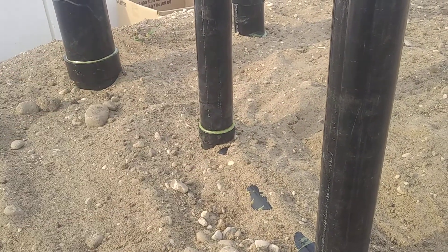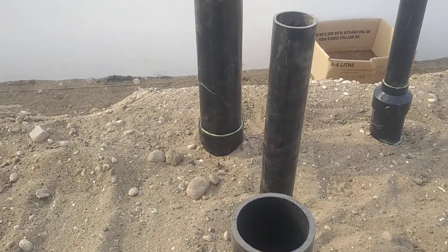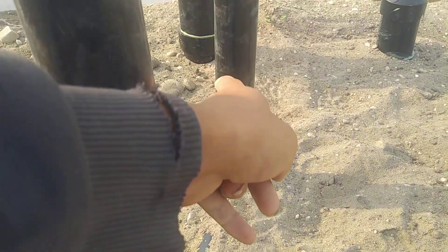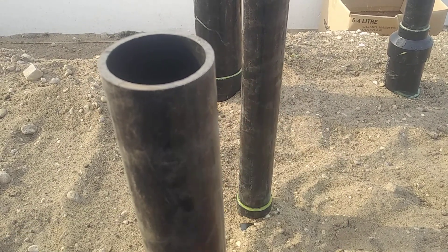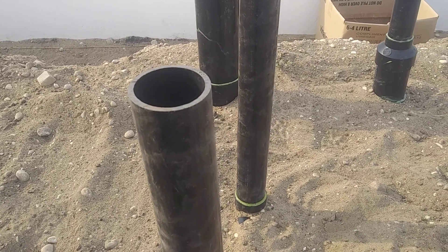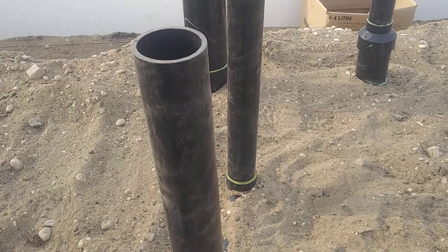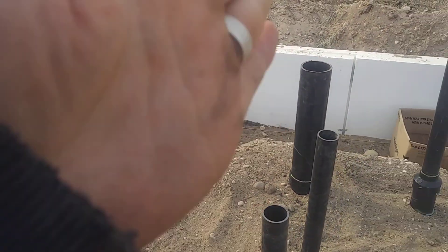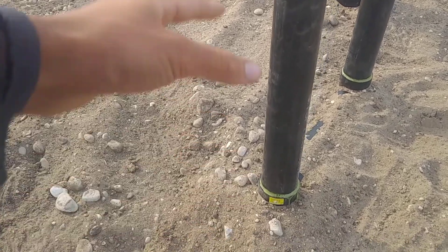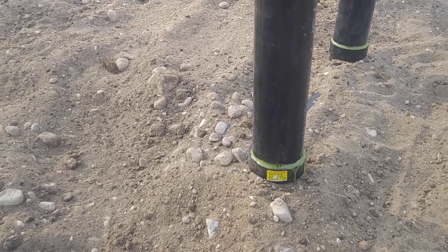I was bending things a little bit in this direction to make sure it didn't hit the wall. Looking at it now after it's done, I sort of didn't need to do that — the toilet is about 16 inches from the wall, we'll see. The overflow drain, if it's off it doesn't really matter because I can always put an angle in. It will be above the concrete and I can move it around later. Keep below the concrete as simple as possible. I won't know the exact precise position until everything's put in place.